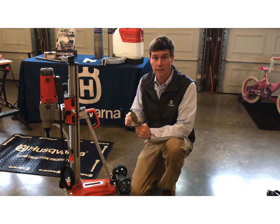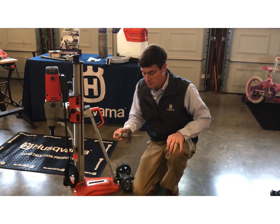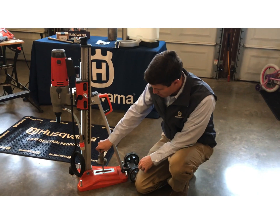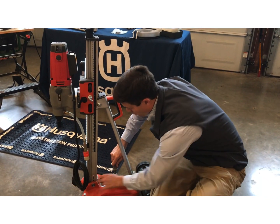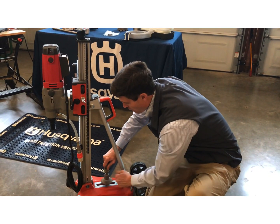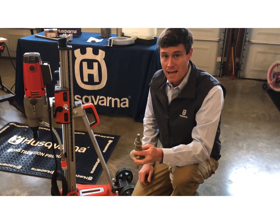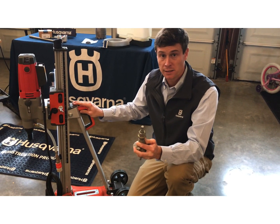Our next accessory is our quick anchor tool — we'll cover more in a core drilling episode. What this allows you to do: when you go to anchor and put it down to the drop anchor, rather than having to make multiple revolutions to tighten down a regular nut, just three or four revolutions once you get it to the drop anchor and you're done, set, and ready to drill. Once you're done drilling the hole, simply back it out — again, three or four revolutions — and move on to the next hole. This is a great add-on accessory when you sell the tool, and a great point of difference for your rental fleet to let customers know what's out there.